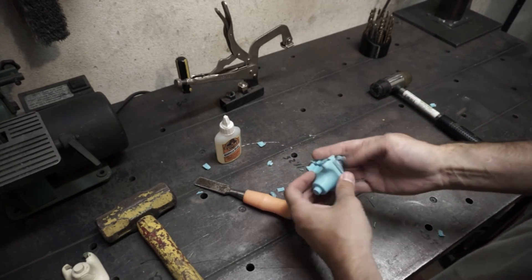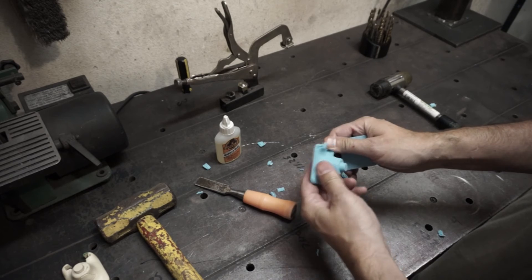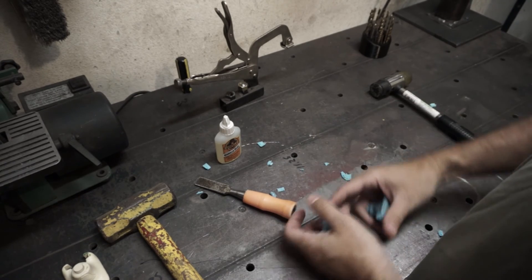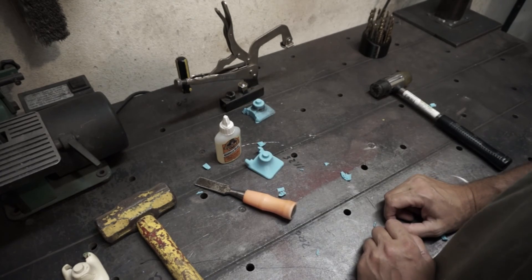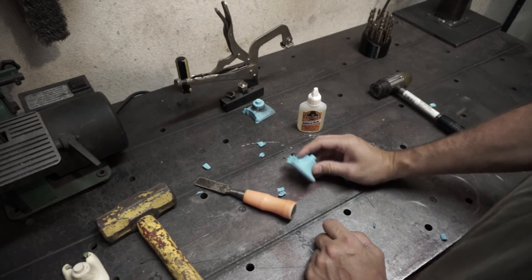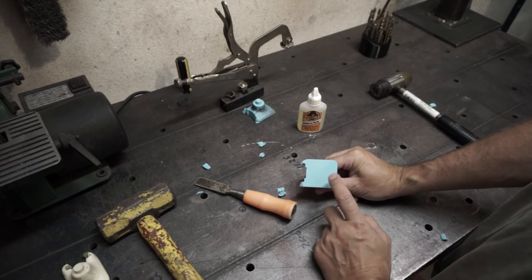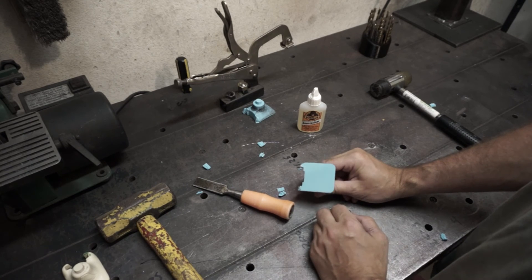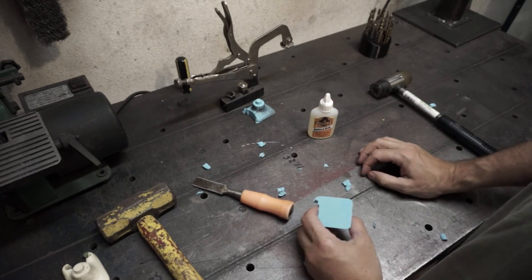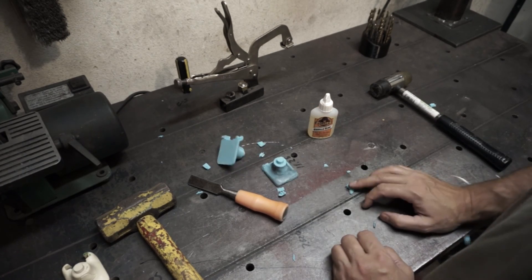So for making patterns and sticking items together where I'm going to be using the dovetail notches and stuff, I think this glue is going to work pretty good for me. Next video I'll probably show you how we made Keith's next pattern with the dovetail notches. That was just for fun, seeing if this glue would work — and it seems to work pretty well. PLA is really hard to find stuff that will glue good to it, so if you know of a glue that works really well, send me a note. I've tested maybe 10 different glues and most of them I can just give a little tap with a hammer and they'll break right apart, but this seems to be holding pretty good with just a very thin layer applied.